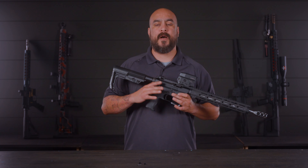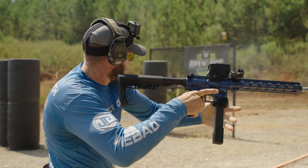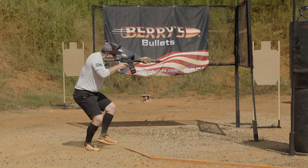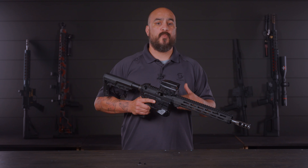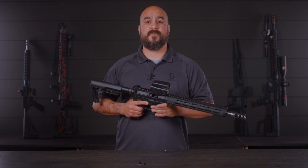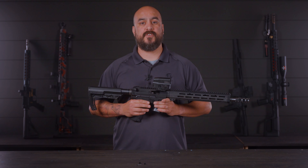In the past video, we talked about bolt gap and how to measure it. As you continuously put tens of thousands of rounds through your JP5, parts are naturally going to start to wear. As they wear, the bolt gap is going to get wider. Another thing to consider is that as we replace parts, such as our lock piece, the bolt gap could get knocked out of spec, which is ten thousandths to twenty thousandths. When this happens, it could start leading to cycling or feeding issues.